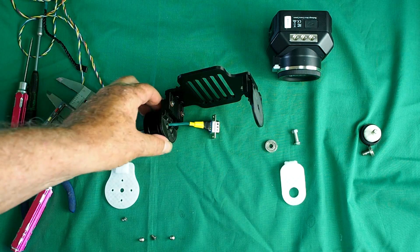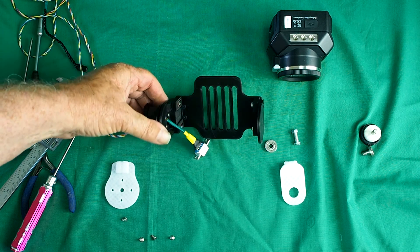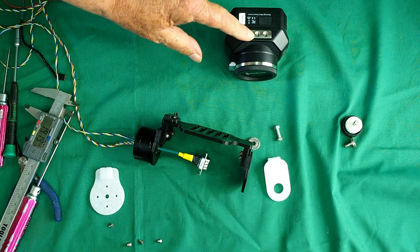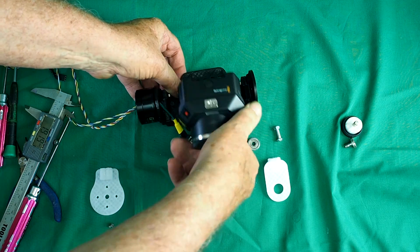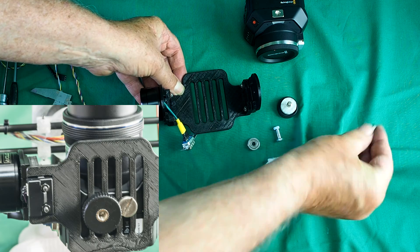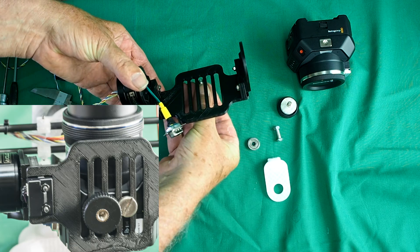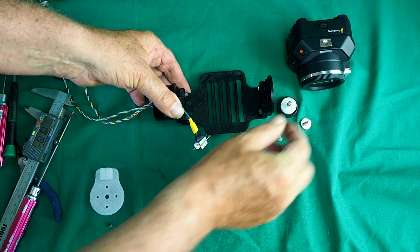Now I've bolted the motor onto the tray. That's the camera control lead that goes onto the camera and the IMU lead. Before we go onto the roll axis, I just need to say something about mounting the camera on the tray. The Blackmagic has three tripod mounting sockets, so you can mount it very firmly to the tray. I use two of those — one that I can easily adjust and another one to lock it. The back is slightly longer than the front because the camera goes back a bit. The slots are drilled out so you can easily slip the bolt in and slide it.